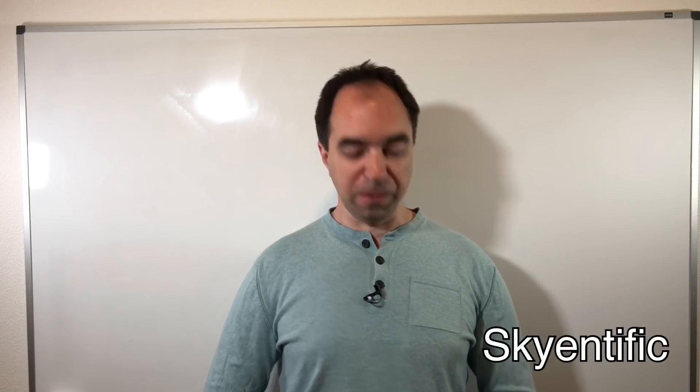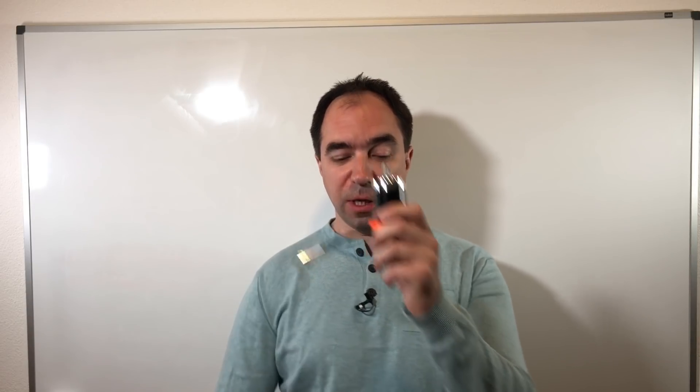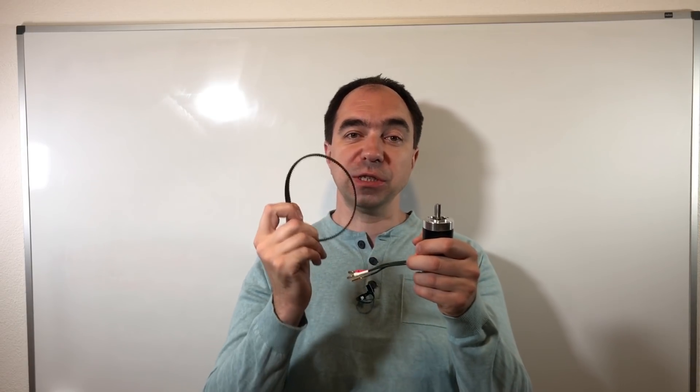Hello and welcome to my channel. Today we're going to take this robot actuator which has some backlash. This robot actuator we built several weeks ago, and to this robot actuator we're going to add some additional reduction stage using the belt system. With this additional reduction stage, theoretically we should reduce the backlash of the entire actuator because this one has backlash.